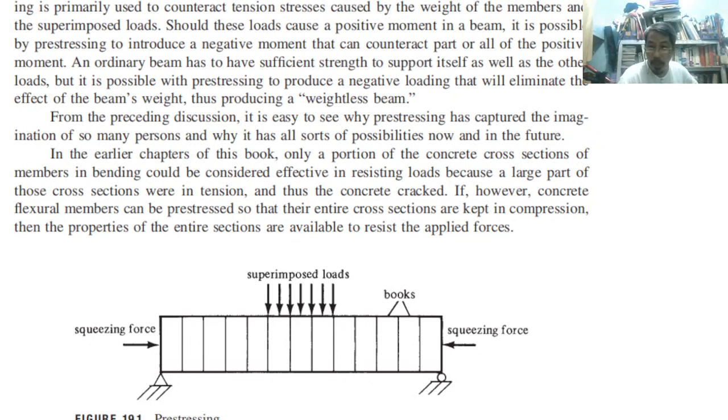In the current construction technology, we have so much pre-stressed application. They are made in the manufacturing plant, then delivered to the site, right? And with pre-stressed members, they already have the reinforced steel bars stressed to the point that it is squeezing the concrete components. Okay.